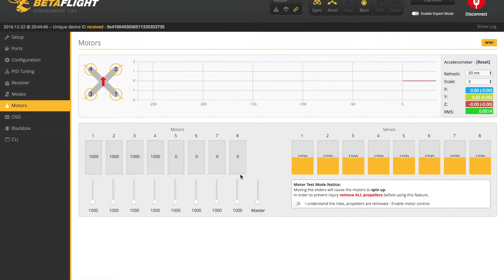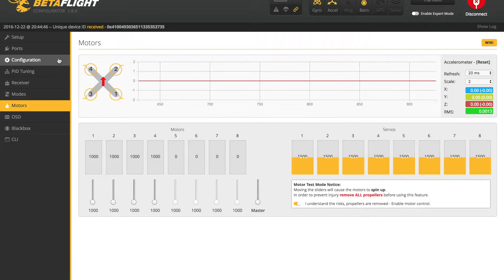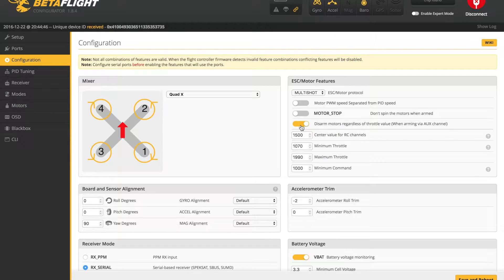The next thing I'm going to do is calibrate the motors. Please make sure you have your props off for this. I'm going to check this, crank it to 100%, and then plug in your battery. Your ESCs will do the chime, then drop the power back to zero, let it finish the chime, and then pull off the battery. At that point, calibrate it. I do this without having first changed the maximum throttle, so it's normally set to 2000. I'll calibrate it to 2000, and I'll drop it to 1990 to get rid of that dead zone at the top of the curve.